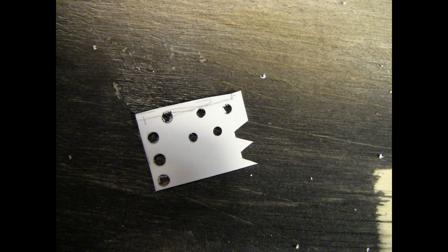Now to hold these axles in place between the plates down at the bottom, I want to cut some little squares with holes drilled in them. So I drill these holes and then cut out the squares that I need to mount inside the flanges down there. And I have a way now to mount those down there, and they'll set in those grooves. And I previously had these 2 side plates mounted underneath the tower, and I got to come back and mount the plates on the other sides, and that gives me the place in between to mount the axles.